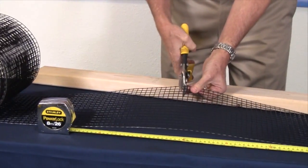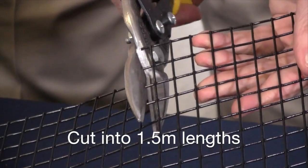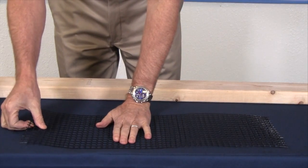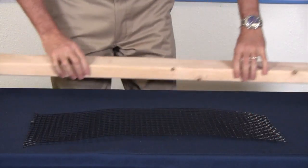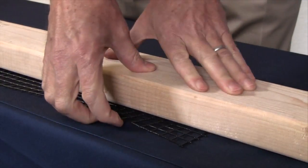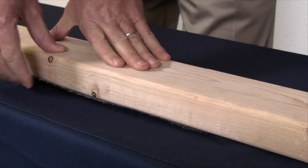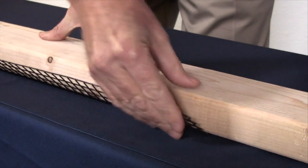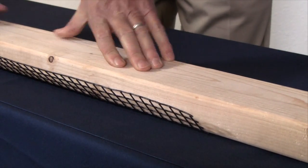Using a pair of snips or shears, cut the mesh into five-foot lengths and straighten them. Then bend the bottom three squares of the sections up to about a 30 or 45 degree angle. Use a piece of scrap lumber to help bend the mesh evenly — we used a two by four in this example. The flange stiffens the mesh, making it easier to work with.